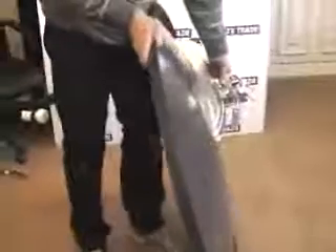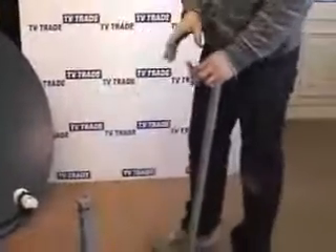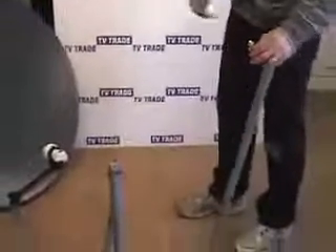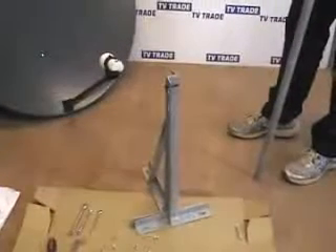That's the basic assembly of the dish. The next products you can use in conjunction with this are a 24-inch T&K bracket, which mounts on the wall using heavy duty 10mm projecting anchor bolts, along with a steel bar that mounts off the wall. The idea of using such large brackets is that they'll be solidly mounted and, being 24 inches out, give a full 180-degree rotation. Smaller brackets like 12 or 18 inch might cause the dish to interfere with the bracket itself. That's it from beginning to end — an overview of the assembly and installation of the 110cm solid universal dish.